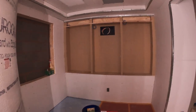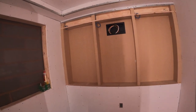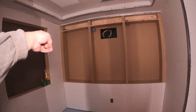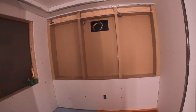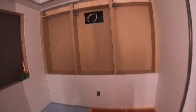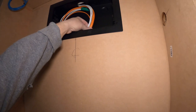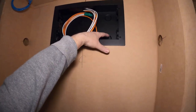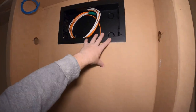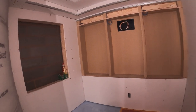One of the larger features here: we have three 55-inch Samsung commercial displays set in video wall mode — video wall one, two, and three. A player runs to an HDMI splitter, it's all 4K, and the TVs know how to break up the signal. We've got a strong in-wall closure with network wires and video wires for balun — everything's Cat 6. There's also a five-port automated switch so we have a power outlet we can turn on and off. If we ever need to reset or power cycle the TVs, we can do it via computer without pulling the framing off. We do that remotely at a lot of customer homes.